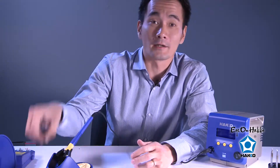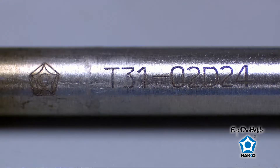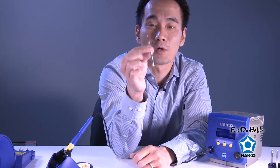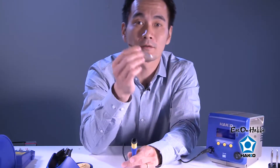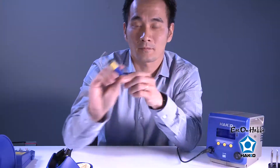How do we use the FX100? It's really, really simple. First, you select your tip shape and temperature. You can do that by looking at the part numbers inscribed onto the tips and also by looking at the color end caps located at the very end of the tips. In this case I selected a 1.6 millimeter chisel type tip in the 660 degrees Fahrenheit temperature range. Once you've made your tip selection, make sure your station is turned off, grab your tip, insert it into the handpiece, and just turn on the station. That's all you have to do — we call it plug-and-go soldering.